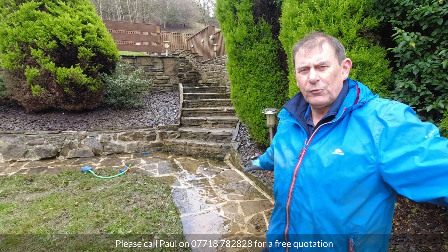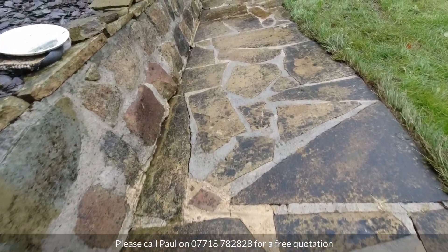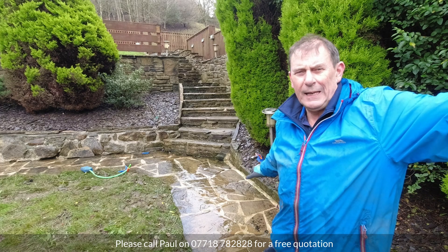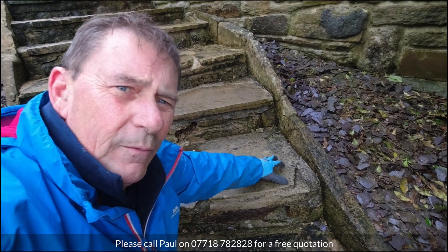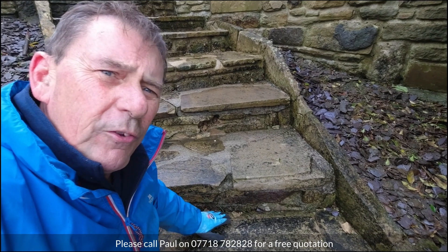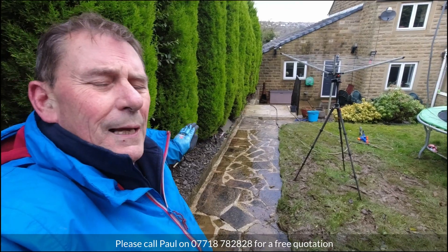That's really common with Yorkstone and very difficult to treat. In addition to that, the stone is quite carbonated in places. This is probably reclaimed stone taken from one of the mills in Leeds or Bradford or Calderdale. These steps are a case in point - the black speckles that you can see are black lichen and very difficult to remove, especially from Yorkstone. And these more solid areas that are also black in colour - well, that's carbon and no amount of pressure washing is going to move that.